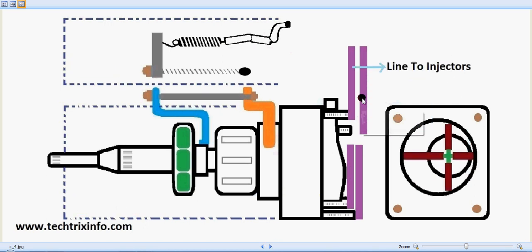These are the injector lines — this is the head of the pump. From these injector lines, the connection goes towards the fuel injectors. Fuel is supplied from the fuel tank into the fuel injection pump through that line. This is the head of the fuel injection pump and the rotor — the side view shows the rotor and how it fits inside the head.